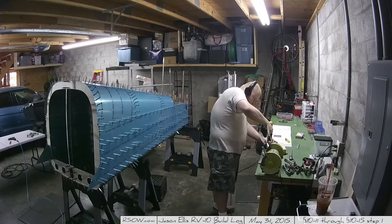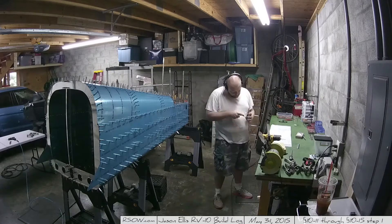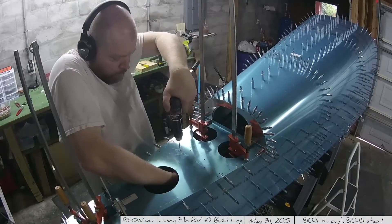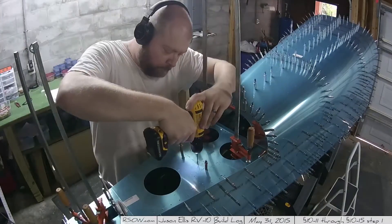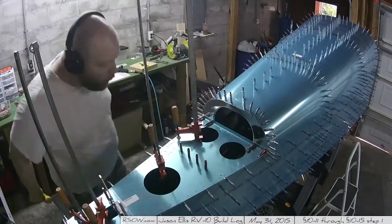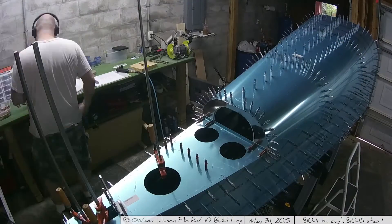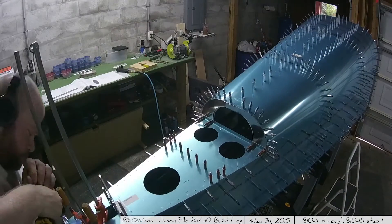Right here I'm working on the 10-13 parts — several angle attachments that you have to drill a bunch of times, shape correctly, and put on the back of the plane. This is a prime example of where the pneumatic drill wasn't working for me. The angle aluminum is really thick, and the pneumatic drill was slowing almost to a stop — not zippy at all. So I switched back to the Dewalt, which is starting to growl a little but still chews through thick material much faster.